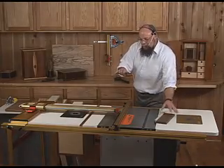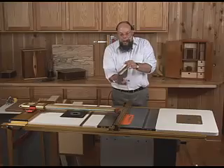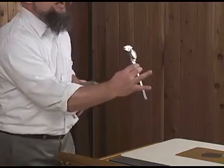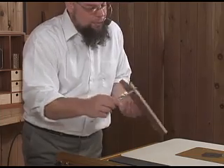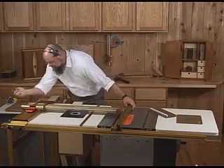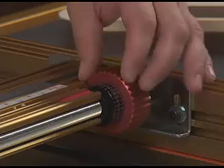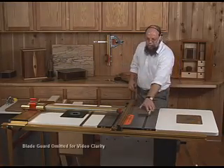What I'd like you to consider is: don't make any test cuts at all. You have to know exactly what you're aiming for. Your tape measure tells you the thickness of the walnut is about three-quarters of an inch, but an inexpensive set of calipers gives you all the information you need. It's nowhere close to a real three-quarters of an inch — it's two-thousandths of an inch shy of 25/32nds in thickness. Even a random dimension like that is a really simple setup: the positioner's mechanics get us a perfect 25/32nds from the blade, then it's no big deal to make that space two-thousandths of an inch smaller to match.